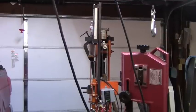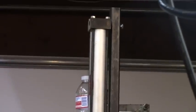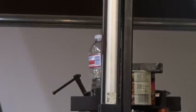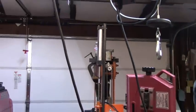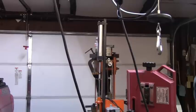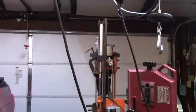All right, so going to the air cylinder means I had to put a new bracket. It runs right up the side of it there. I have to have about 1/4 inch standoff from the bracket to make it line up all the way top to bottom. But there you have it. That's the new setup. Of course, it'll have to be cleaned and painted and then assembled, and then I'll have to work out how to handle the air. You know, I guess I'll have to get a nice valve to go on the inlet. This is, as far as I know, a one-way cylinder. It'd be nice if I had a spring to push it back up, but that's wishing for a lot, you know. I don't know I'm going to find a nice strong 10-inch spring. We'll see.